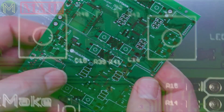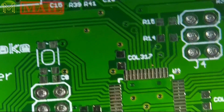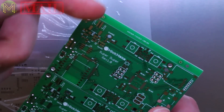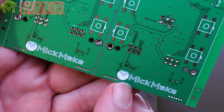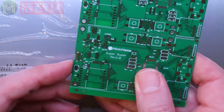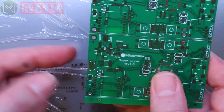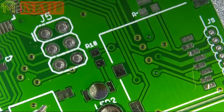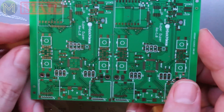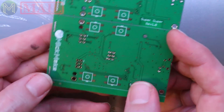When I designed the PCB, I made the text fairly small on purpose to see how the silk screen would come out. You can see all the capacitor and resistor names — they're all at 0.6. They seem to have come out fairly well. My logo came out fairly decently, although it's really hard to create a proper logo. It was supposed to be faded, light at the bottom and lighter at the top. On the flip side it came out slightly better. I also designed a small cutout in the end of the board for the USB port so the USB connector can fit snugly into the case. Some of the vias look like they haven't been connected, but I buzzed it out and they're actually connected.